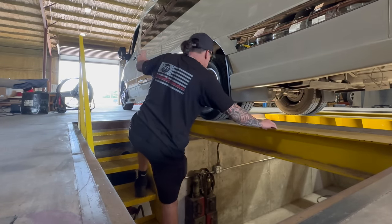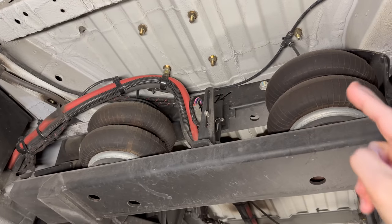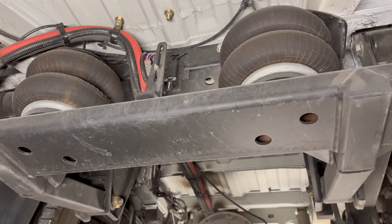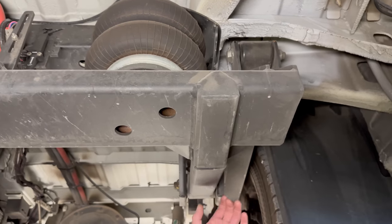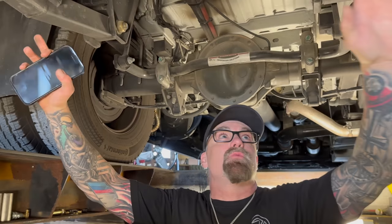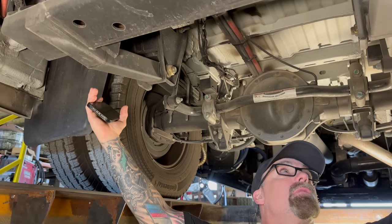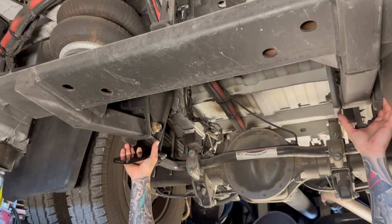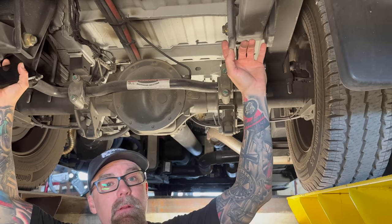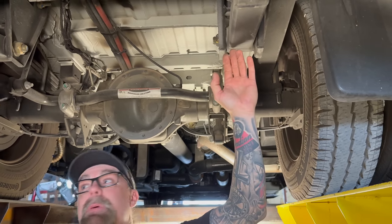One thing that I was amazed with is how close these airbags are, and still given the stability, you would think they would have to go out further. Right, well, the biggest key is we would use this large square tube, and this whole swing arm acts as one piece. So where the extra stability is coming is being right underneath the frame right here, and then we're on a really large bushing in here, so that it helps with the top being top heavy.